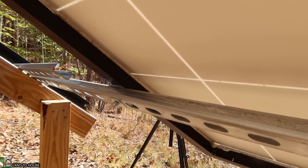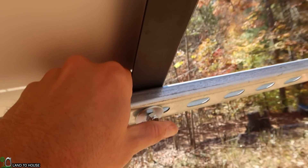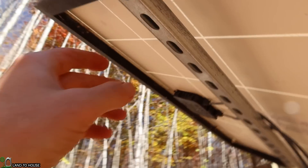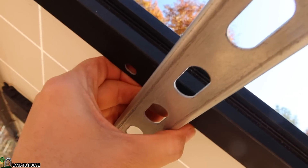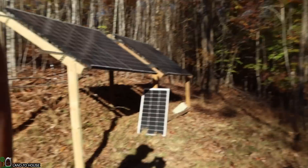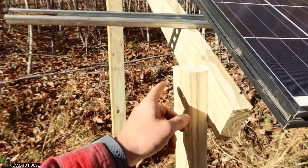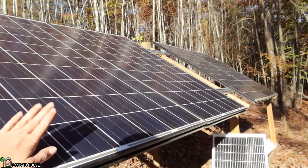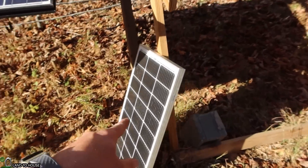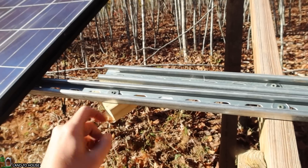This is what the bolt looks like on the back side. I haven't tightened them down yet, but at least the panel is holding up. I'm going to take a wrench and a socket set to get all of these tightened up. But I've got to move the unistrut up and make sure it lines up with the hole before I lock it into place. You can see I used a screw to hold it there temporarily. My sister stopped by and we went for a long four-wheeler ride, but I'm back out here to do more work. I've got the new 260-watt panels installed. It looks like I probably could have dropped this down just a little bit more — there's a slight angle to it, but it's close enough. I added some little blocks of wood because the post was poking up a little too high; that'll keep it nice and secure.